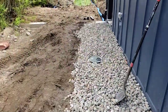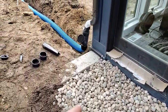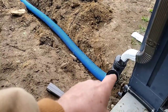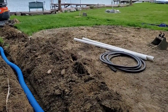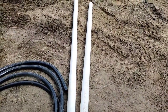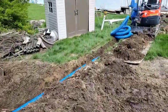We have this massive chamber right here — ridiculous chamber. We have rooftop water coming off the neighbor's house and all this sheet water coming off the drive, and we're now catching all that water right here. The guys did a really nice job on that discharge line — it's stubbed. In the trench they're digging, we're running the roof runoff system with 3-inch schedule 40. We're putting our seamless, fittingless, no-glue-joint flex schedule 40 through it. If somebody hits this pipe with an aerator, it won't hurt anything. We use the hard pipe for its crush rating and the flex schedule 40 can move up and down in the freeze and thaw.